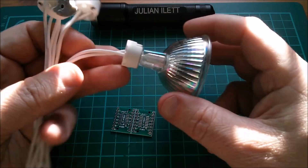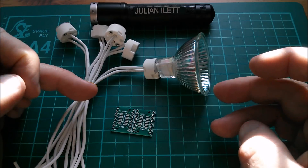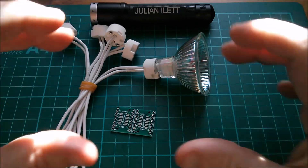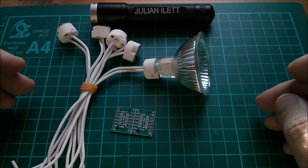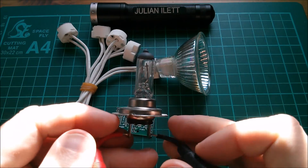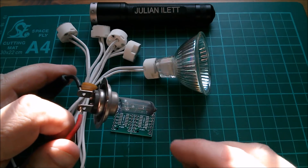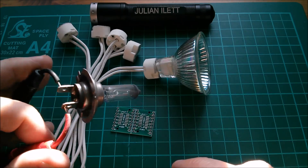I've been watching YouTube and looking at various ways of doing low-tech reflow. One guy had a 500-watt halogen security light, converted upside-down into a mini reflow oven. I've also seen people using regular car headlight bulbs — H7 and H4 types — just holding them literally above the chip to make it get very hot so the solder melts and reflows.